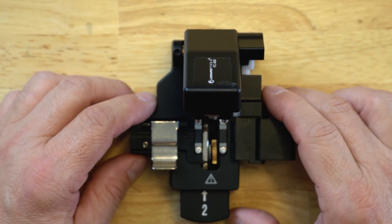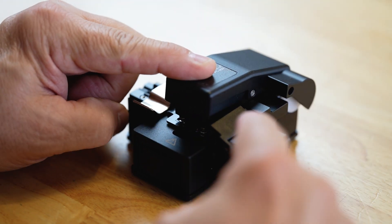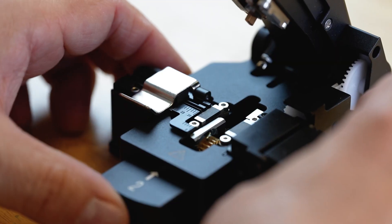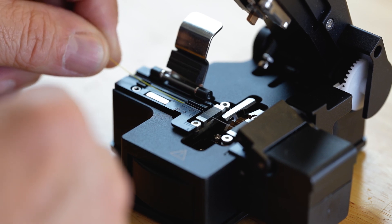This tool is perfect for the fiber-optic technician and fusion splicer that demand high accuracy in their fiber-optic cleaves while doing fusion splicing. The one-step design automatically cleaves the fiber, rotates the blade, and collects the fiber scraps. The tool provides a cleave with a cutting angle of less than 0.5 degrees for optimal fiber preparation for fusion splicing.